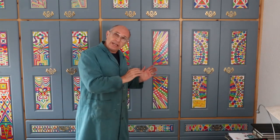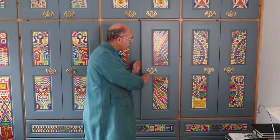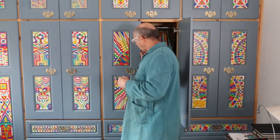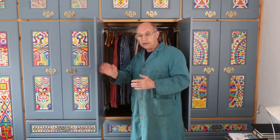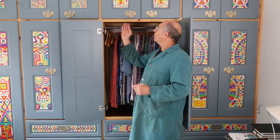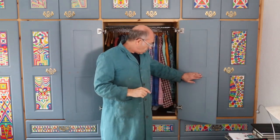I've brought you up here to show you the operation of the hinge. The hinges we have here are not the standard type. In our kitchen we have standard hinges that open to just over 90 degrees. We want to get clothes in and out, but there isn't much room before we hit the bed. With these hinges, from the frame out is 170 degrees, and it does the same on the other side, giving you loads of access.